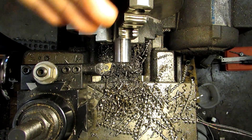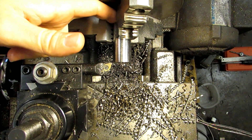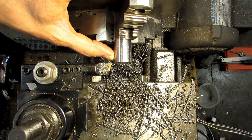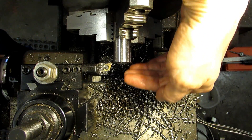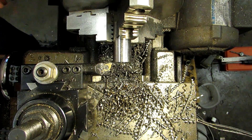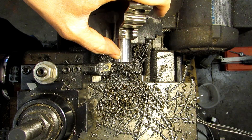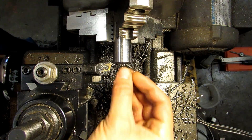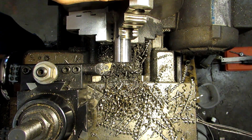I've reset my zero on this face for an easy visual reference for depth. This is going to be the mating part to all the bores we've been doing, so it's going to be 125 thou deep but plus nothing, minus 10 — so we're shooting for 120 thousandths so it won't bottom out in the bore, which could cause rocking or error. Likewise, the diameter is nominally 800 thousandths but plus nothing, minus 4, so we're actually shooting for 798 — that way the boss will fit into the bore without any problems; we'll just drop them together.